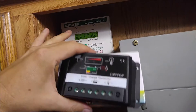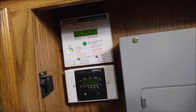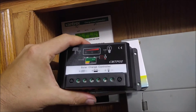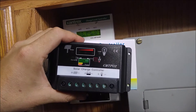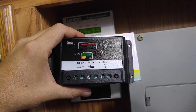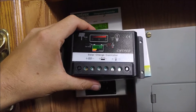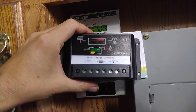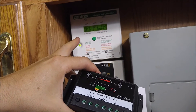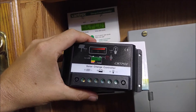The things you get with a C40 charger are the ability to have an externally mounted display and a full watts and amps output display, versus this one which only has LEDs on it — not a big deal for the average home user. Most of the time you've got one or two panels and you're just trying to charge some 12 volt batteries. Something like this is perfectly okay. Don't hesitate to buy this cheaper charge controller; you don't really need 40 amp charging capability.